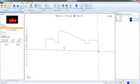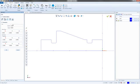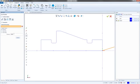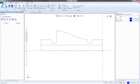Now, if we did have a hole in it, well, then we wouldn't have a perfect center line. But I'm going to go ahead and put the hole in. So I'm just going to go to Create 2D and then Line with my parallel again. And this time the distance is going to be 6.25 divided by 2. And so I'm just going to go from the bottom straight up, just like that. And now, again, I'll use my utilities, quick trim, and then I'll just trim off that, that, and that. And the best part about doing it this way is now when I go to do the revolve, all I got to do is hold shift, click the geometry, and it's going to do it.